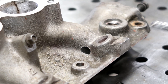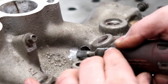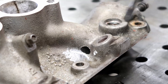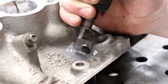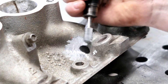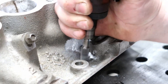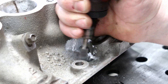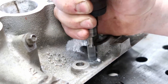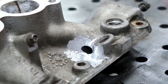The first thing you're going to grab is your carbide burr or die grinder. This is an aluminum intake plenum off the top of an engine so it's going to have tons of grease and oils baked into it, and what we want to do is clean up around our hole or crack. You want to grind down and get those surface impurities off because cast aluminum is porous and it's going to hang on to those. Your objective is to grind that surface off. If you have a crack or fracture you'll want to grind a little bit out of it so you can get penetration of the weld. In this case we have a hole, so we just want to clean up a wide swath around it.